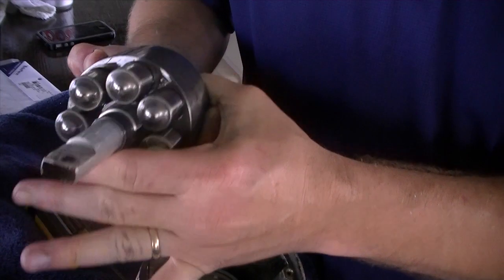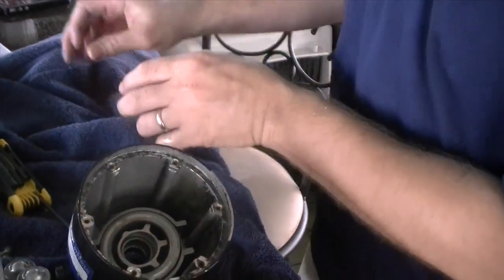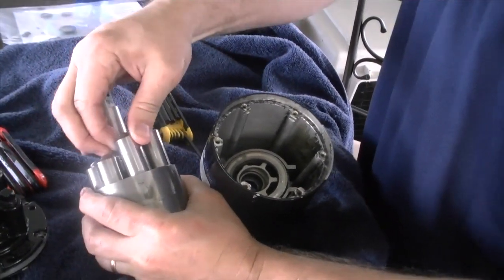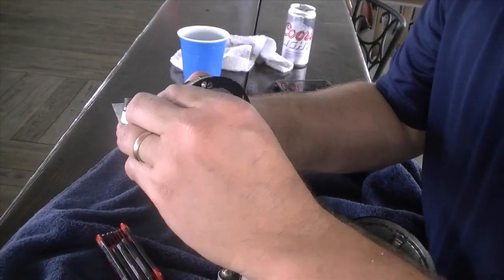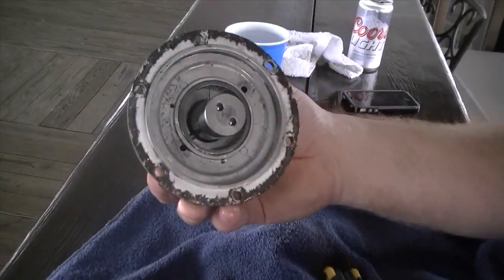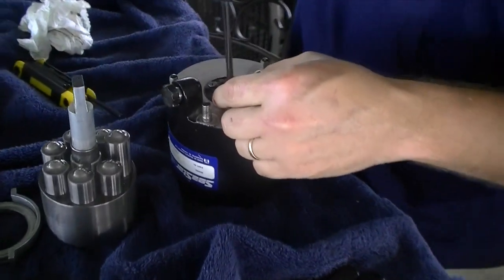The bearing race attaches to this and pushes each one of these pistons down as you rotate — they go down in succession and create the pumping action, pumping hydraulic fluid. Apparently these seals have gone bad. The main one is this rear seal right here — it's nasty and gooey, you can see it's all wet so it's leaking. We're going to make sure we clean this very well around the edge so when we tighten it down it's not going to leak.